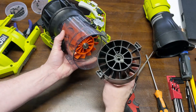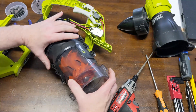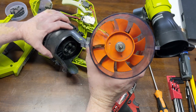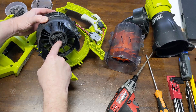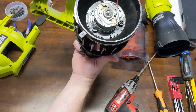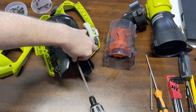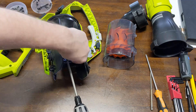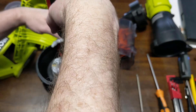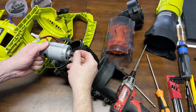We can remove the front part of the jet fan — don't lose the little silicone retainer for the little spring. This part should slide out with the jet fan. We can actually see the coupling is eaten up. We have to remove these four bolts that retain the motor on the C-face — the front part of the motor. Now we have three screws in here — just the motor support on the side really.